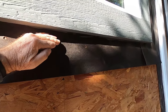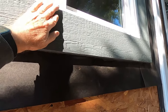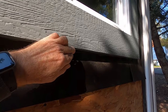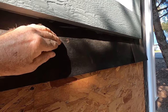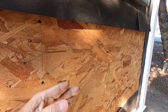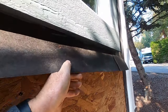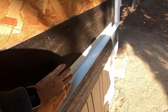If we put our house wrap on top of this, our flap ends up underneath the house wrap. What we need to do is loosen the tar paper here underneath the window — the house wrap is going to go up underneath this flap. Then this flap is going to pull down over top of the house wrap, creating our overlap there. We'll be taping all these seams, and that's how we get waterproof underneath the windows. If you just go up here with your house wrap, any water that comes off this window could creep back and get in on the other side of the house wrap — in between the building and the back of the house wrap. So the house wrap is going to tuck up underneath this.